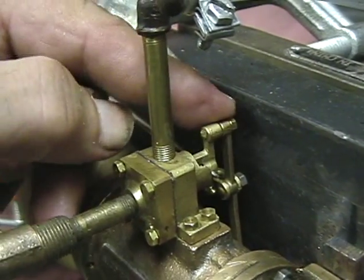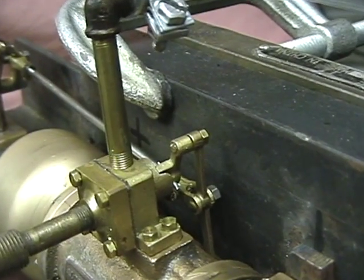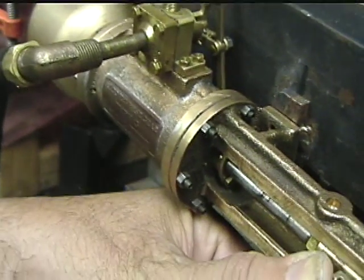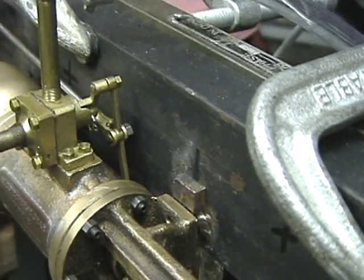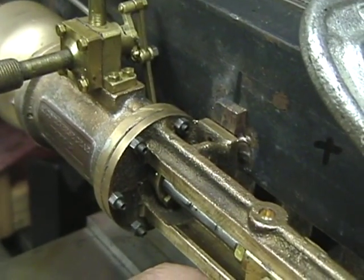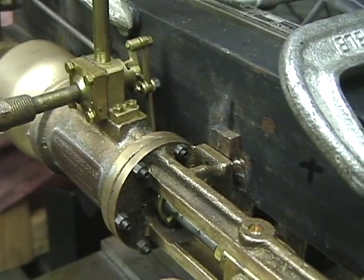That's of course in the middle. As I move this — moving the crosshead now with my finger — you can see the valve start to move. That's centering the valve. I'll move it back, and as I move this, if you watch the valve up there, I'm moving the crosshead back and that valve is centering itself, coming back towards neutral.